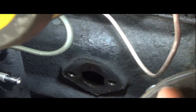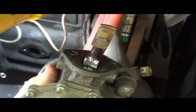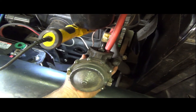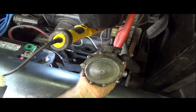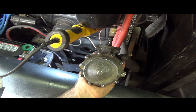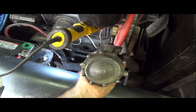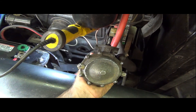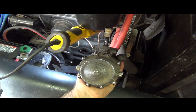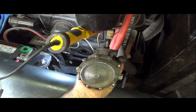There's a gasket still on the pump. I was dreading those bolt holes for a moment because it looked like there wouldn't be much room to get in there, but with an extension you have just enough to get past the body of the fuel and vacuum pump and get it out pretty easily. Let's put it on the bench and take a closer look.